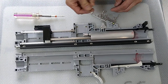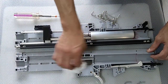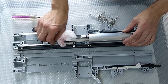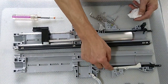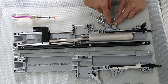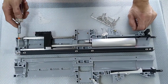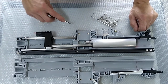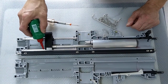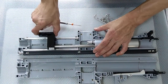This is the plunger tube area — it's a little bit oily because I have lubricated it already, so I'll just wipe it off a bit. You can actually do this during maintenance: wipe off the excess grease or oil from your blaster, and then re-grease it again. This is the trigger that activates the sear. The two nuts here are very important — please remember not to lose them and to put them back when assembling. This is an M6 nut and this is an M4 nut — these two nuts are required to secure your grip. These are actually the stainless steel rails. You can lubricate them using sewing oil — just remove the cap and dip it along the rails. This should give you more lubrication and your rails will be smoother.